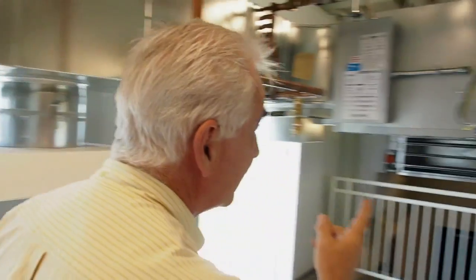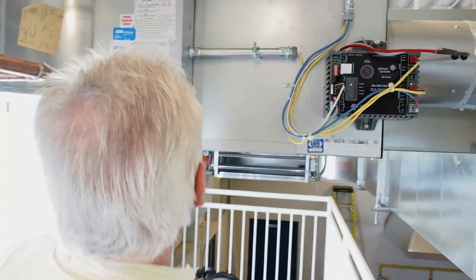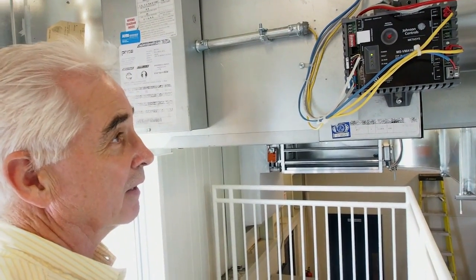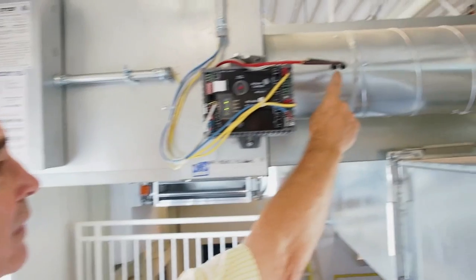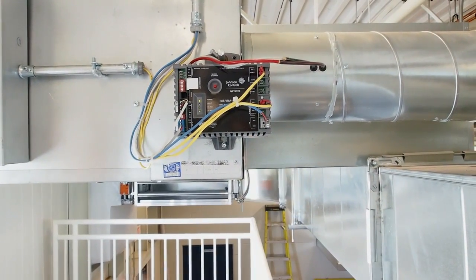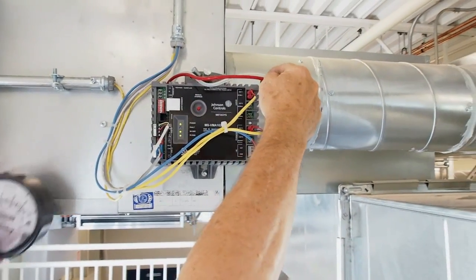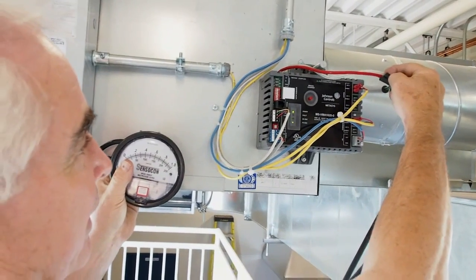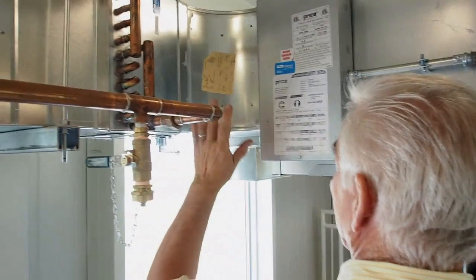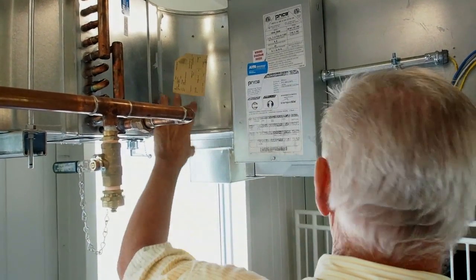This is a fan powered box. It has a fan in it, so we can set the speed of the fan so it always produces a constant flow rate of air. Here we have a pressure independent module for the primary air — this is our cooler air — so we do the same thing here. We measure in parallel with the building automation system to see how much primary air we have, make sure it has the right parameters set, and then we measure how much air is flowing because this is a constant flow rate device.